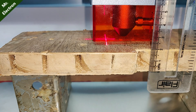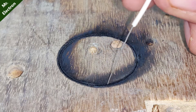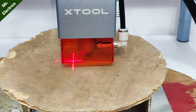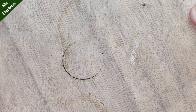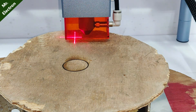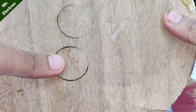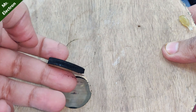Now I'm going to try and cut a thick wooden block in the form of a circle. I'll measure the depth of this circle cut — the depth is 1.7 centimeters. Here I'm going to cut a circle on 5mm plywood in a single pass. It was almost done — let's try again. I've set it to 100 percent power, speed 2 mm/s, one pass. Let's check it — it left a little bit, let's push it. Wow, it's quite nice!